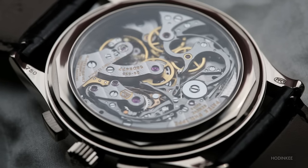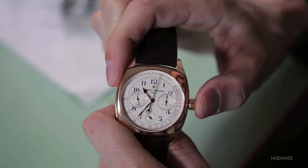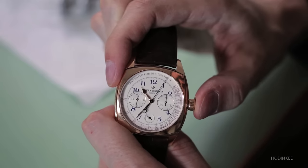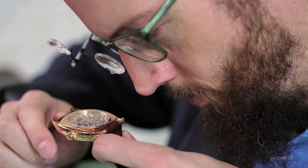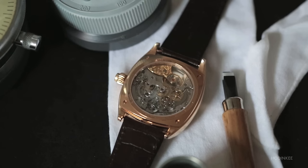The one that really appeals to me the most from a technical perspective is the Vacheron Constantin. The solution they've come up with using this coaxial steel wheel is pretty cool. Beyond that, a mono-pusher chronograph is technically a lot more difficult to put together and get working well. With that being said, the pusher on this Vacheron Constantin is not working too well right now — it's definitely much stiffer than the Lange and the Patek. But it's something that can be adjusted and fixed. Looking at all three of these movements from a technical perspective, the Vacheron Constantin is what really jumps out at me.